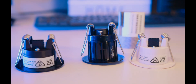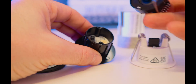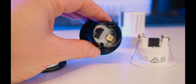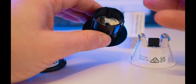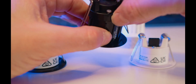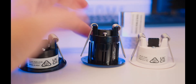Then we have the same version in IP67. As you can see, we've got a rubber grommet at the top and access to the internal part. It's all enclosed and sealed from this side. Once you bring the cable through into the connector block, seal it back up and screw it back down, it's ready for an IP67 environment like outdoors or bathrooms.